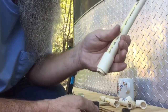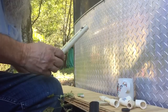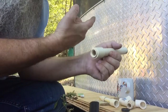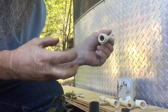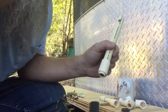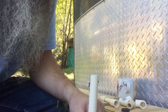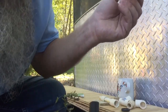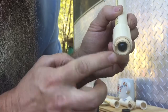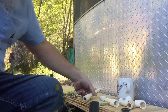Okay. See that? Let me cut this off. All right. So what happens is you got your pump. You push down on it. The marble goes up, and it's loose enough in there where water passes through it and around it. As you push down, the marble goes up. The water passes around it, and so that's pushing in. So when you pull up, the marble comes down. That's what happens. It fills that hole and keeps the water as you're pulling up, and then when you push down again, it shoves more water up in there, and that's how that works.